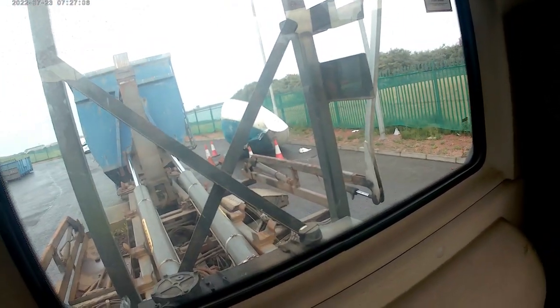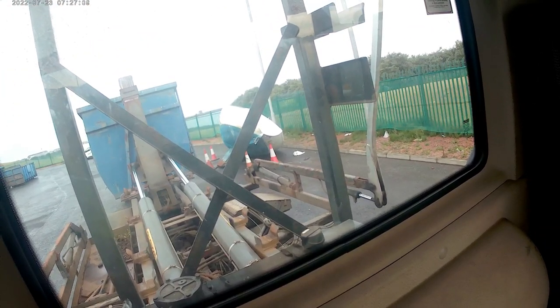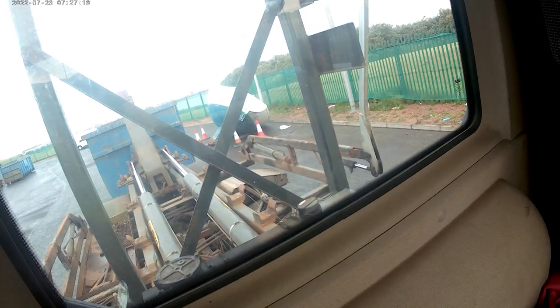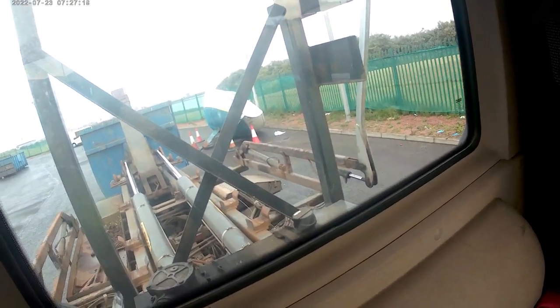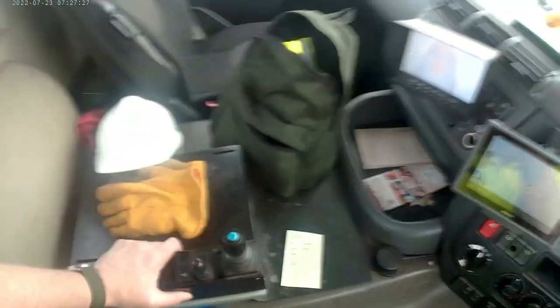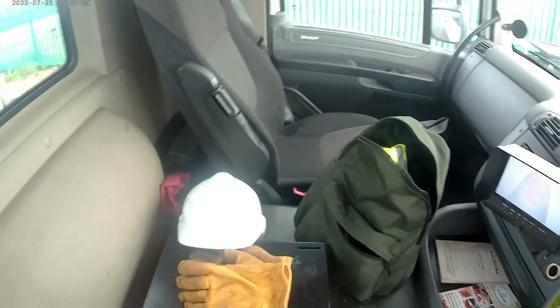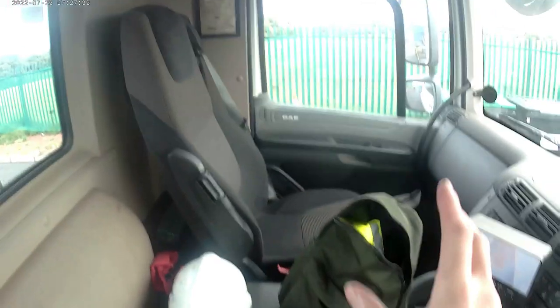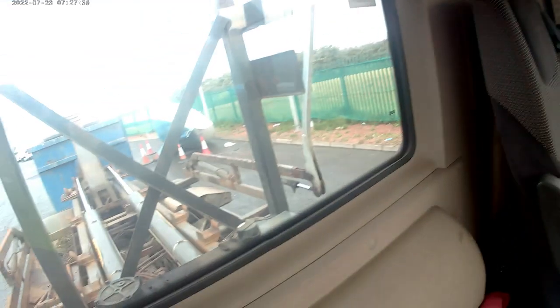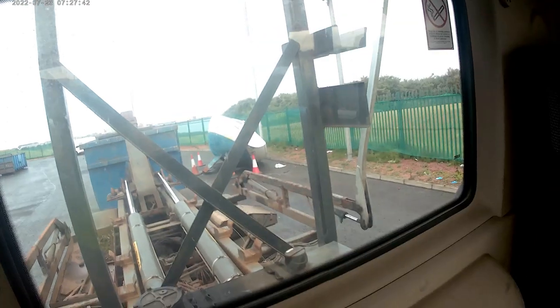And it's the opposite way when you put it on. But this has got a bit of an arse of a thing in the hook — there's an extra button to press. It's got a wee clip in the hook that doesn't always come off first time. So this wee blue button here — that's a bit of a problem. The actual hook has got a wee safety hook on it as well, and if you don't get the button right but it hits the ground, it doesn't come off. You can be sitting for three or four attempts before the skip actually comes off.